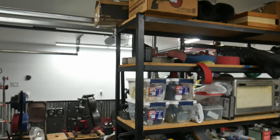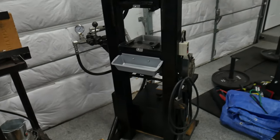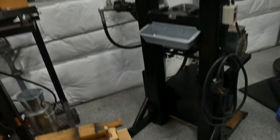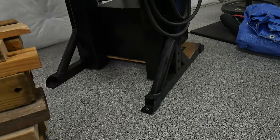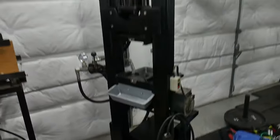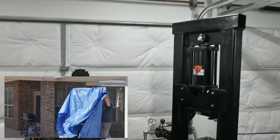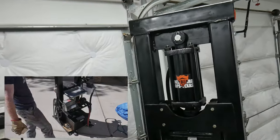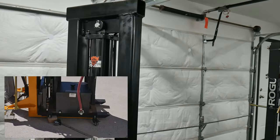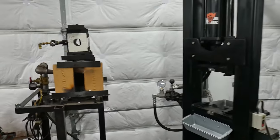You may notice that my hydraulic press has been brought inside the shop, as opposed to being wrapped up in a tarp outside. In order to get it in here I had to take the wheels off — it didn't quite fit in the doors. So if you're building a press after watching the DIY press build video, make it about an inch and a half shorter so it can get inside standard doors with wheels on. Also, the wheels I had were pretty cheap and one broke, so get steel wheels.